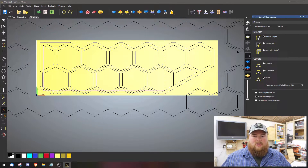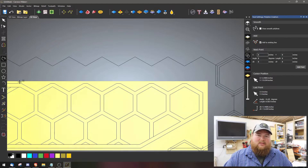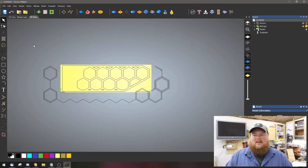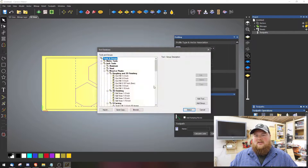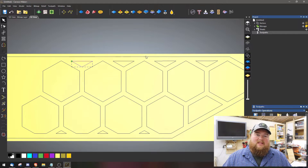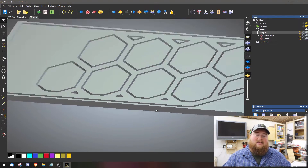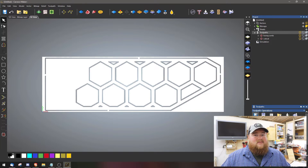After a long bit of playing, learning, messing up, deleting, and redoing, I finally had a design that I liked. I like the honeycomb pattern — it reminds me of honeybees. I wanted to incorporate that in my workshop to give a little bit of a cool design and a hint of nature here in this non-nature shop. Once I was happy with the design, it was as simple as generating my toolpaths, which in this case were simple profile cutouts or 2D cutouts. The honeycombs were cut on the inside and the bracket was cut on the outside, and I added a couple of bridges to keep the bracket in place.